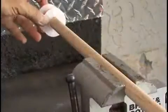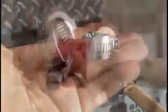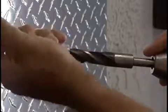I found a wood dowel that fit right inside of my enameled wire spool and put that in a vise. And using a couple of hose clamps, held the enameled wire gently in place. I also found a drill bit that fit perfectly inside my acrylic tube. So I put the tube over that and also made a little mark using some black electrical tape on the chuck so I could actually count the number of windings.